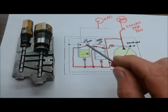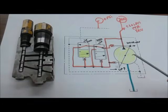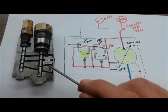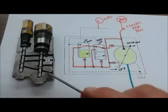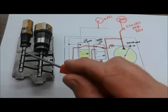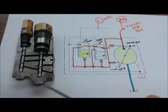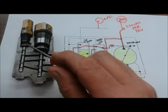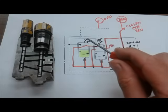You can see that this arrow is going to be available to drain to the case the pressure behind the control piston or the destroke piston. So that connection there gets made every time the pump upstrokes. This connection here gets made every time the pump destrokes based on comparisons between load sense signal and pump output pressure. Because at startup or standby, load sense is zero. All the pressure has to build to is the value of that spring, which of course is just 300.